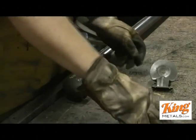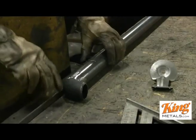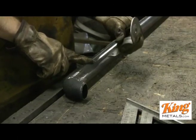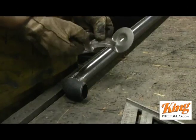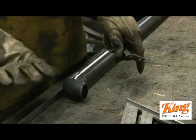I'm going to take my bracket and my speed square, and first I'm going to take my railing and butt it up against an edge — I have this angle on my table. I've already marked where I want my bracket to be, so I'm going to be putting it right here. The beautiful thing about most of these brackets is they're already beveled a little bit, so they're going to fit tubing nicely.